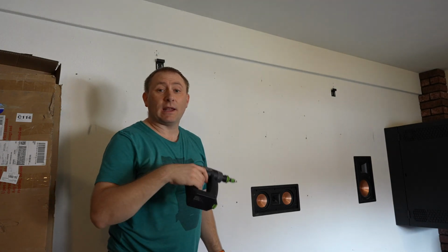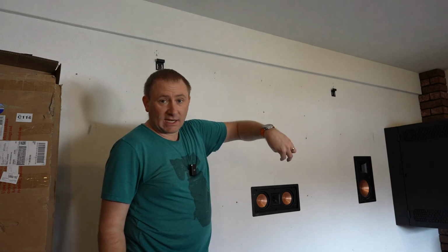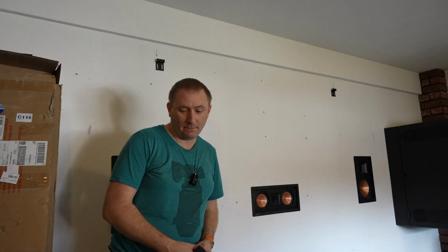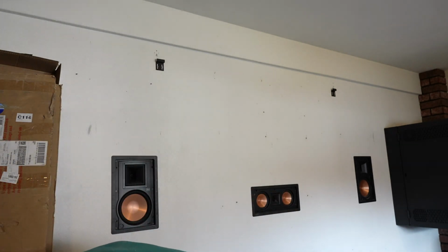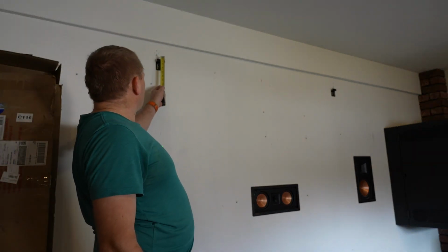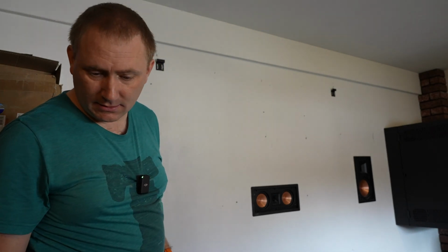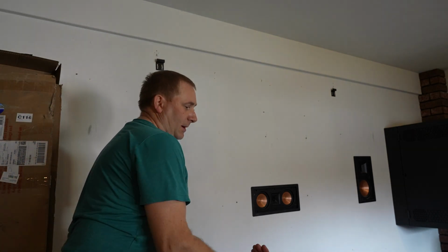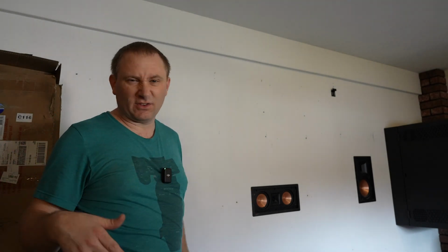Top ones are done. Now the bottom ones are going to be a little bit different. Those are going to be what I would say are called floating. Right, so we'll actually attach them with 2 fasteners again, but not tight. They should float. I just got to know the measurement between the top and bottom, basically the inside of the top and the bottom of the aluminum, which is in this case 47 1/8. So the difference between this and the bottom edge of that one is 47 1/8. And then those will actually lift up. They're just there to basically, we hook up the underneath, hook it on the top, and then they just float down to keep it from going in and out. So you'll see in a second.